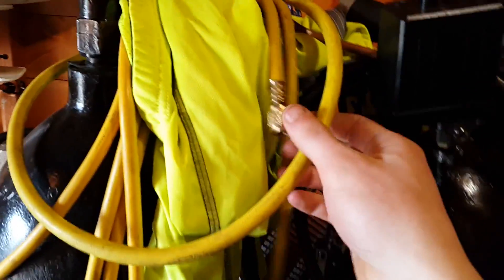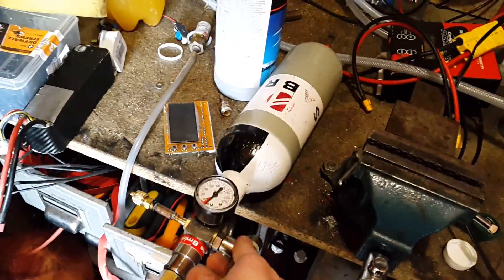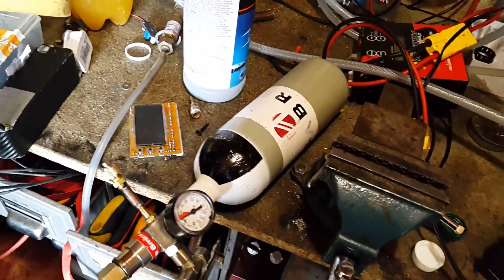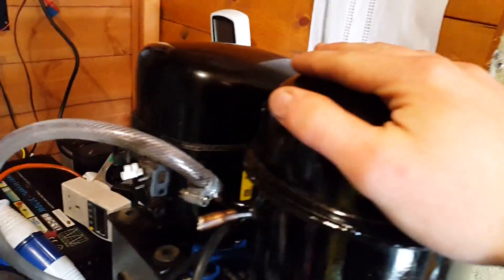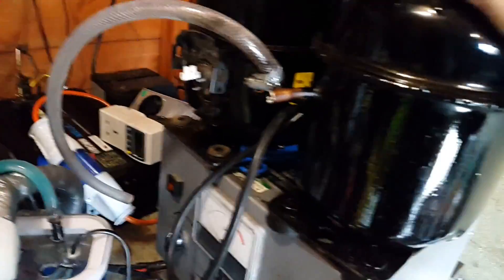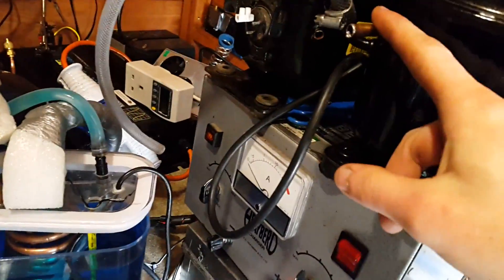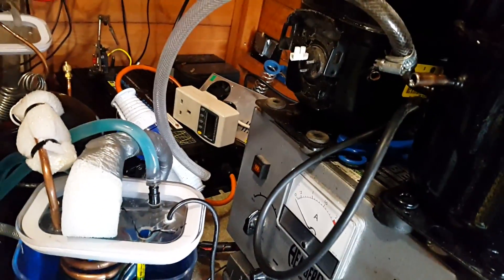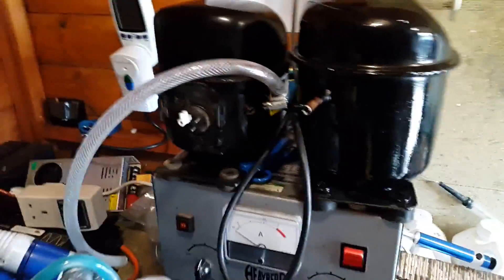You're also going to need refrigeration hoses, probably gauges as well, though I'd get away without them. You'll need a propane cylinder, preferably with the Schrader valve removed — I've got another video showing how I did that. You'll also need a vacuum pump, but you can make one from two refrigeration compressors linked together with the suction of one going to the discharge of the other. Or if you don't have any spare compressors, just buy a vacuum pump.